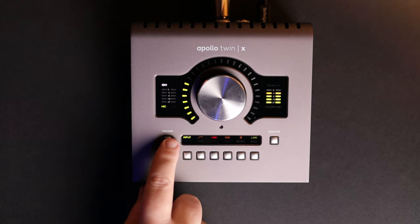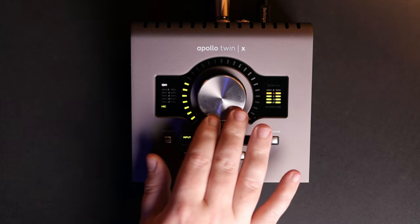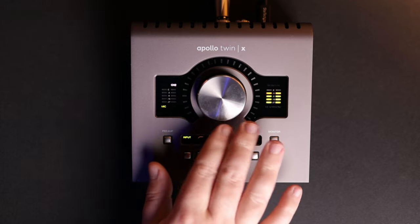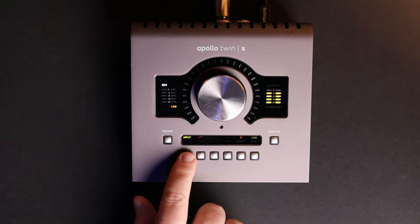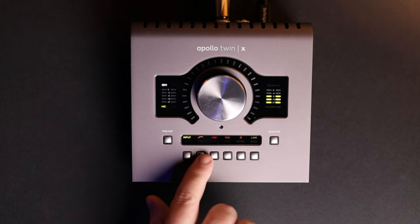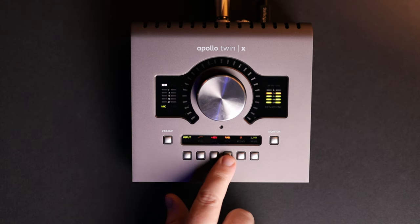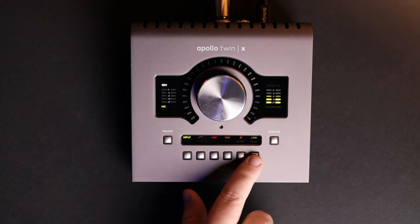The preamp button on the left switches the operating mode of both the volume dial and the six buttons along the bottom. When you push the preamp button, it switches to preamp mode for your first input and the dial becomes an input gain knob. Press it again and it changes to the second preamp. When in preamp mode, the six buttons control the input, toggling from mic to line level, a high-pass filter to roll off lows at 75 Hz, 48-volt phantom power, a minus 20 dB pad button, a polarity switch to correct phasing, and a link button to link both preamps together into one stereo channel.